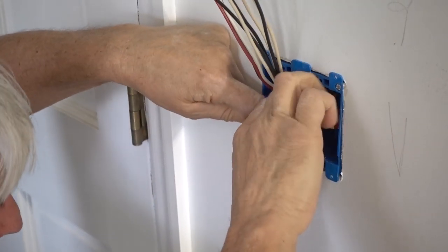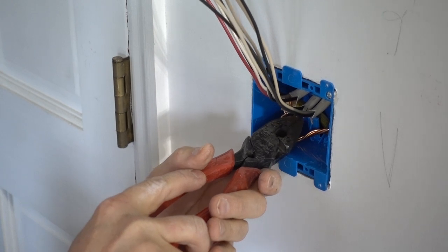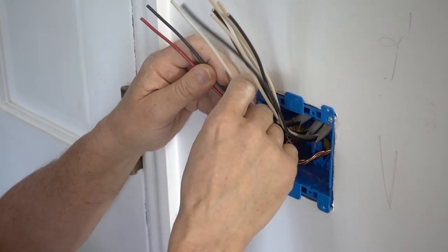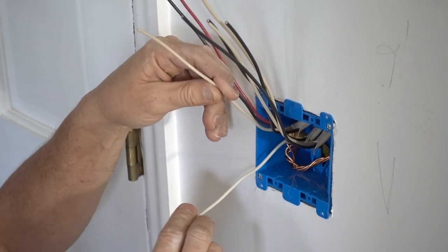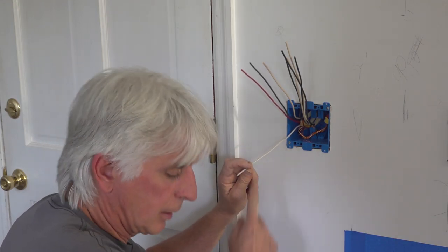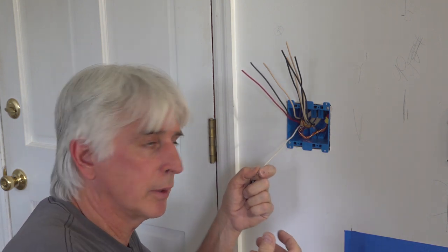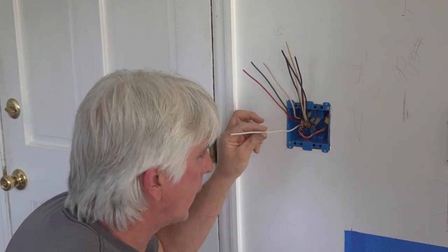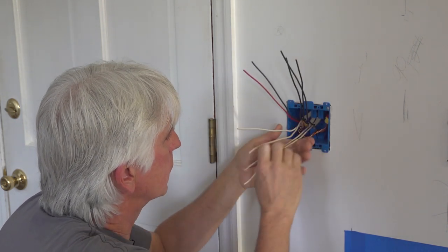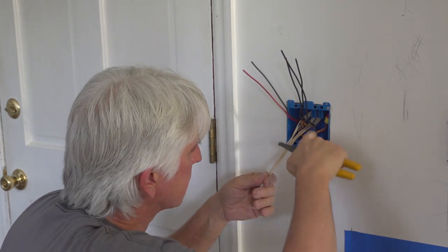These remodel boxes are a little bit tight with kind of stiff wire, so I like to get that back in there out of the way so that my switch will fit in nicely. All the grounds are together. In this instance, this is our three-wire cable — we're sending ground down to that switch, and we're also using that white wire for a neutral. There are many times this white wire could be your hot, especially in older houses — they did it all the time. In modern times, if you were going to use that, you'd take a black or red marker and color that wire. You might come across one that's been colored and know it's probably hot. I've gone into many a house and found white wires to be hot, which is a big no-no now. So all these white wires here are neutral wires. This is about seven inches long — you're supposed to have six inches from the back of the box out; we always give a little bit extra.